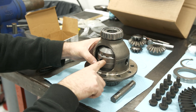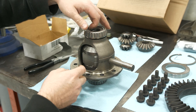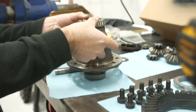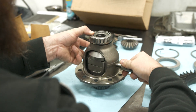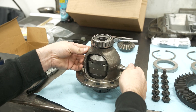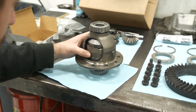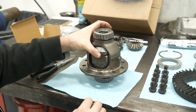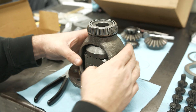With that locked, we've got that lined up. We can rotate it and then slip the center pin through, which is going to take a little fiddling with those two rings that were in there before you put the pin in. You move the center collars up so you can hold it with your finger from the other side. A little fiddly — there we go. Center pin's in. Locker's in. Now we just have to pull these little pins, which will release those springs, and put everything in its place. Now we have a locker.